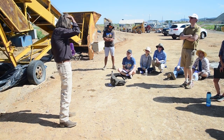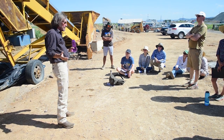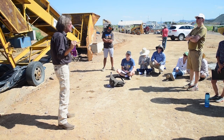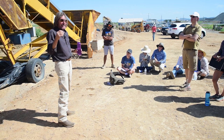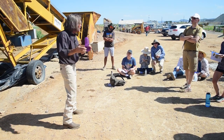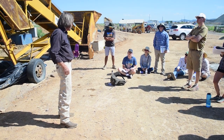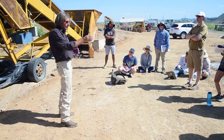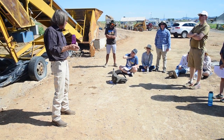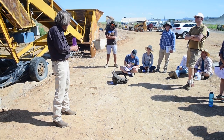Then the other thing about it is that there's moisture, even though it's only 10%, there's moisture in that block, and it's going to leave. And when it leaves, the block is going to shrink. It doesn't shrink very much, but it shrinks maybe 3/16 or 1/8 in length when it cures. 98% of that happens in the first 2 or 3 days. After those days, it's pretty much done shrinking. But the point is, if you take them out of the machine and put them right in the wall, we're trying to build a thermally perfect wall, right? And they all shrink. So every 10 or 12 or 14 inches, depending on your layout, you've got a hole in the wall. Not really the thermal perfection you're after. Even if you mortar the head joint, the block's going to shrink away from there, and you're going to have a little hole. So it's the breakage and the shrinkage that are the reasons why I don't do it.